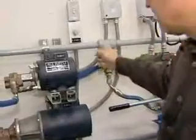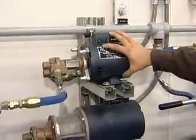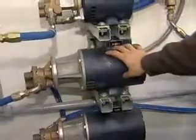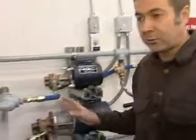Continuing on through the piping system, the smaller pump here is the pump used to fill the day tank — that's a normal fill cycle. We also have an overfill pump-down pump, which we'll explain in a minute. Under the normal fill cycle, this pump operates whenever there's a call for fuel. The day tank is set up to auto fill through the control system.